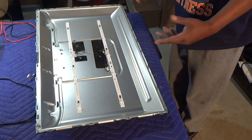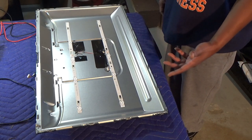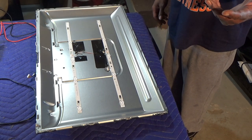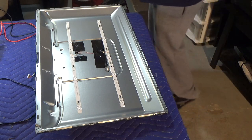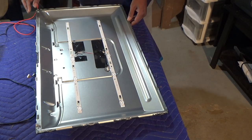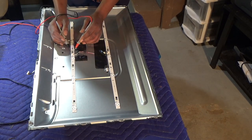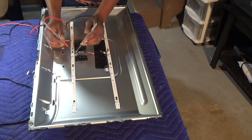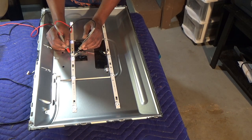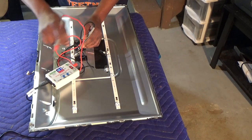I had to stop working on this because it was taking longer than an hour and I had to go to work. This TV is incredibly difficult to get into. Anyway, I remembered we were getting about 50 volts on the LED plug from the power supply. I saw a little backlight earlier. Going right to the LEDs, the plug is marked minus and positive. Going back to the capacitor marked plus — and this one lights up. It's reading stable at 27.2 volts.